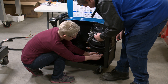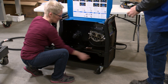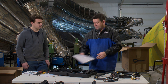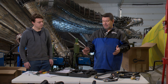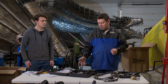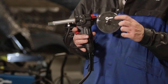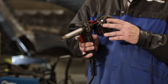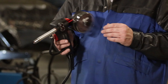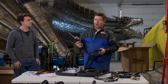The nice thing about this machine is it's a pulse machine. When you're welding aluminum, having a spool gun is a great tool to extend your welding reach. You can do a push-pull out of the machine, or a push-pull gun, or even just a pull gun like I have. It has a nice location for a five-pound spool or two-and-a-half-pound spool. Typically you're going to run a fairly small wire — like .023 up to about .035 — and you can set this up to pulse.